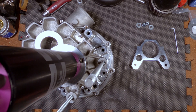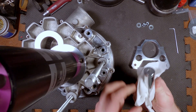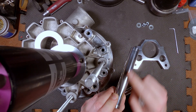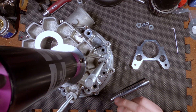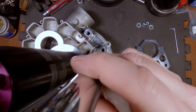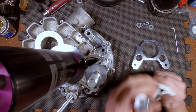So here at Alex Labs, where the future is made today, I like to use the whole buffalo. When I bought my house it came with a really craptastic electric weed whacker with a lead-acid battery that lasted precisely six months. So I used the thin aluminum shaft to make these standoffs, and then I machined plugs at the end to locate everything and add some strength to it. The whole idea here is to keep it lightweight. Plus, drilling a hole that long through aluminum is a bit of a hassle - it gets gooey. I'm getting my fingerprints all over my carefully polished stuff.